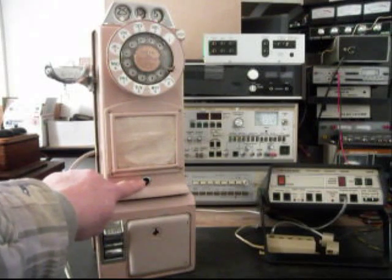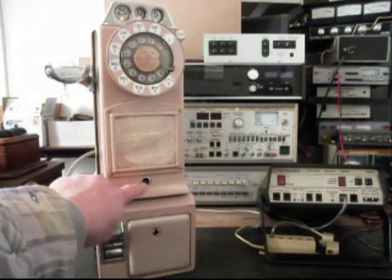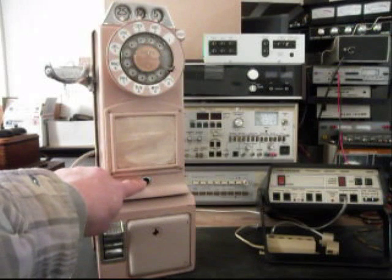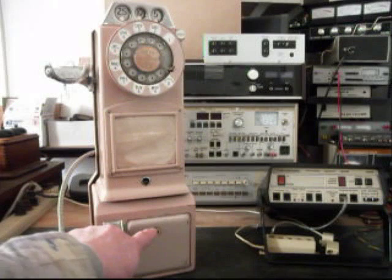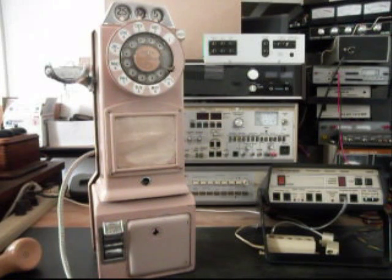There is no locks or keys to the, well, there's a lock, but it's been broken. So we want to put an aftermarket cam lock in the body. Now, there is a lock in the vault, and we're going to have to gain access to the vault area to get the lock out. And probably what we'll end up doing is taking a key and rekeying that key to that lock.